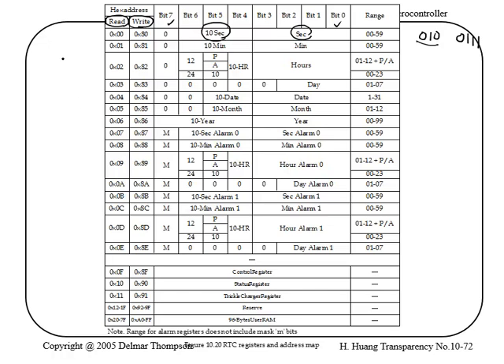If you have a binary value v and want to extract decimal digits, you'd say: decimal digit 1 = v % 10, then v /= 10 as an integer. So for a value of 456, v % 10 gives digit 1 = 6, then v becomes 45, then digit 2 = 5, then digit 3 = 4. All of this can be skipped if your data is already in binary coded decimal, as in this chip.